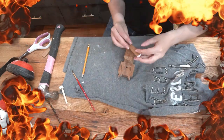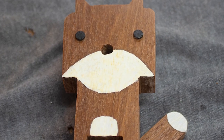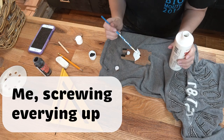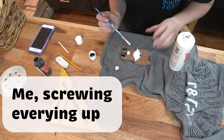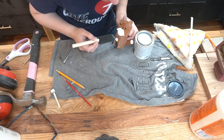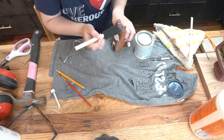But actually, everything is not fine — because the white paint has turned yellow. Yellow, y'all. Remember my big mistake from about 30 seconds ago? I didn't prime before I painted, and this wood apparently has all sorts of tannins in it. So I'll slap some primer on, then slap some paint, then some finish, and then I'll give it to my mom for Christmas.